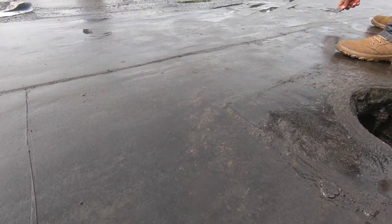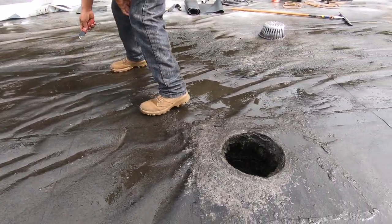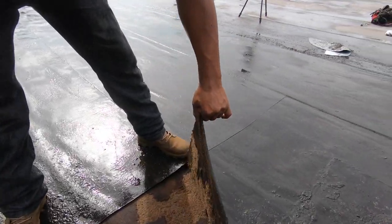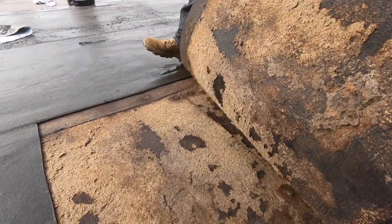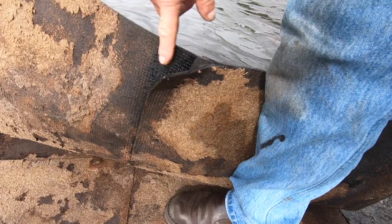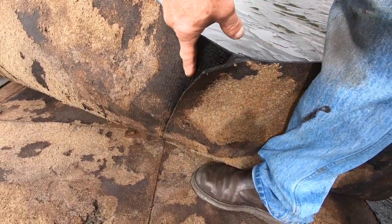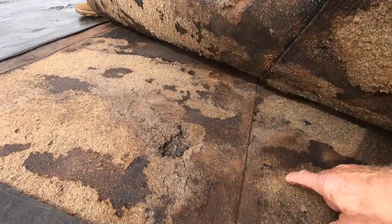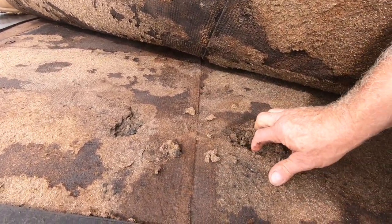It's a good roof, but it causes problems when they don't install it correctly. First thing is, we cut the membrane open here. We're doing like a five by five section here. Let me show you about the underlayment — this roof was torched with no underlayment. It's just a rubber membrane, there's no base paper or nothing to this. And you can see the seams were half torched. This is wet. That's what damages the roof — the underlayment is wet.